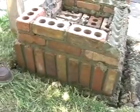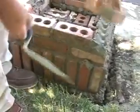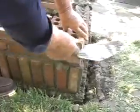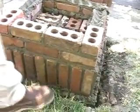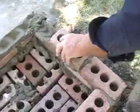Now the bricks are staggered. In other words, they overlap. Half bond, we call that. Yes. And that gives it strength and makes it look better too, and ties it together. So then that's how you would start the second layer, your second course. Remember, you're just going to go around.